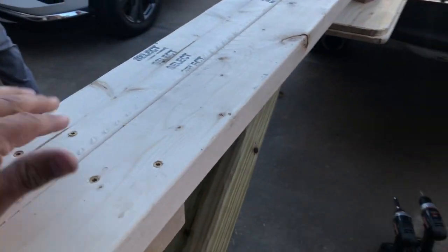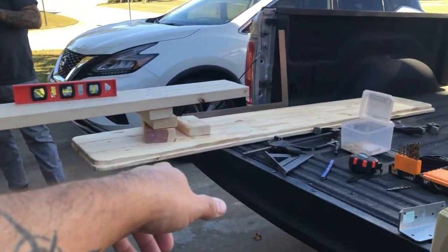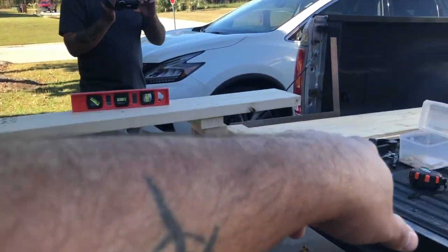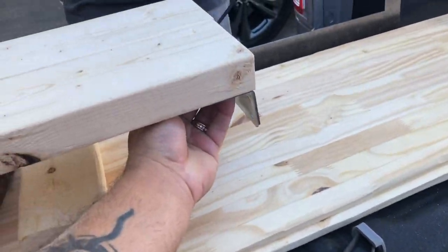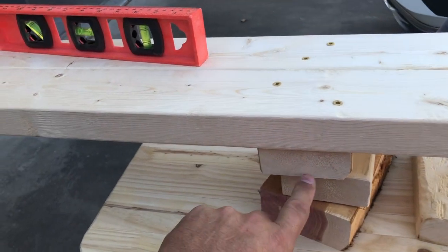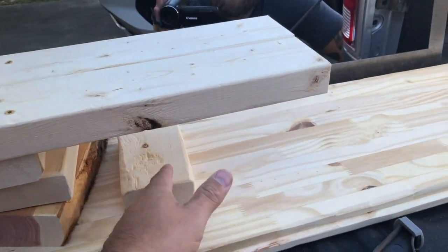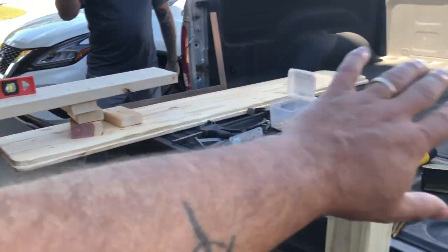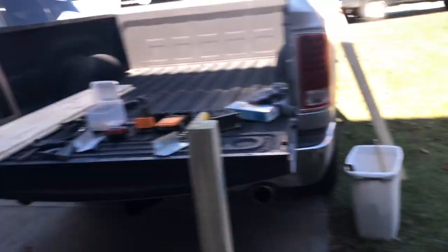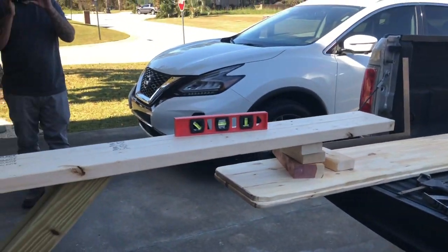We have a support here for a little extra structural support holding everything in place. The idea is to get all this flush, level, and at a 45-degree angle. These are our tops that are going to go on here. This is ready except we still need to put our brackets — this is the 45-degree angle bracket that goes into the metal. It's also in the wood to give extra structural support. We've got to put this on top and attach the tubs. Everything needs to be gone over with the DA sander so nobody gets splinters. We've been using the angle grinder with a flat disc to remove rough edges. We're plumb — I like it.